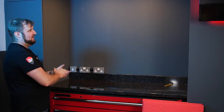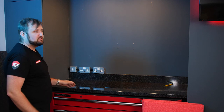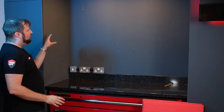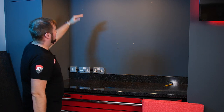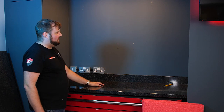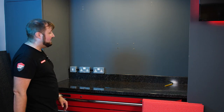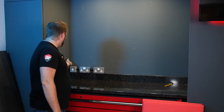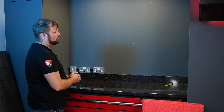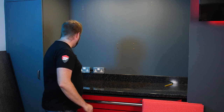These bays are just over 1.5 meters and the maximum sheet size we can do is two meters by one meter. We're going to go for 1.53 meters wide and the full one meter deep, which will bring it down to just above the sockets and light switch — exactly as planned. All we need to do now is put a bottom rail here to hold the foam sheet on the wall with a really snug friction fit. Let's get that bottom rail cut.